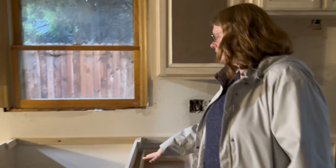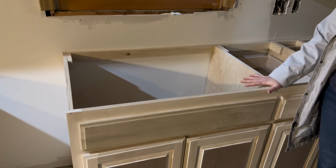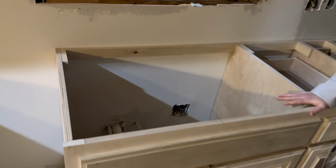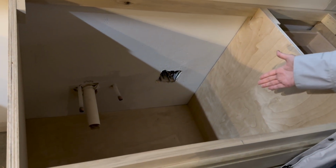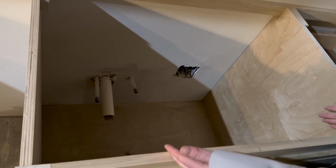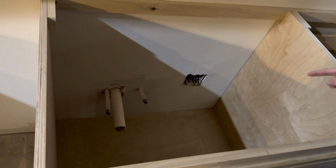The other concern that popped up was the sink that we were shown is a 1 basin porcelain sink, which is wonderful. But I noticed it was kind of odd because the drain was over here. It wasn't centered, it was off to the side. And so I stand here going, the showroom sink has a drain over here, my plumbing's over there. That's a problem, because this entire cabinet's going to be taken up by plumbing, and I won't have any storage for cleaning supplies. So a question for the counter people is if the sink can be switched so we can consolidate the plumbing and make this cupboard more useful.